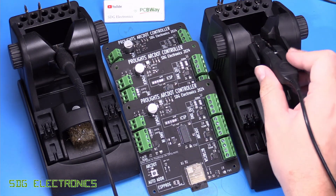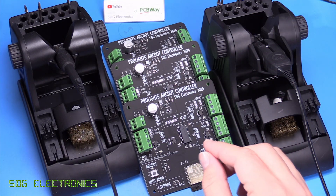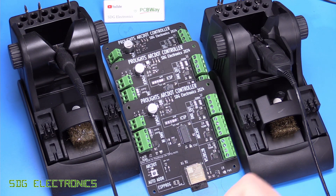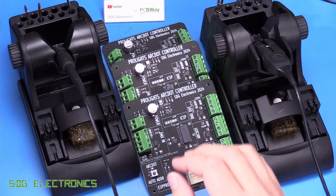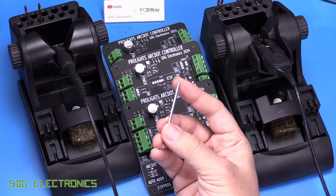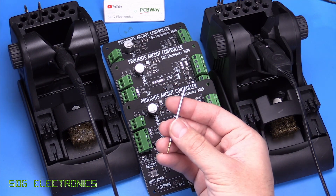Really, really nice tweezers. But these are for a very specific use case — if you're planning to do general purpose soldering, these probably aren't the tools for you. These are for precision soldering under a microscope. If you're working on things like motherboards or mobile phone PCBs, you'll probably also want an infrared preheater to bring the board temperature up to around 100 degrees, so you're not wicking away all the heat. These cartridges have very small heaters, and like any precision soldering iron, there's a limitation as to how much power you can deliver into the board — some took quite a long time to heat up due to thermal vias onto large thermal planes.